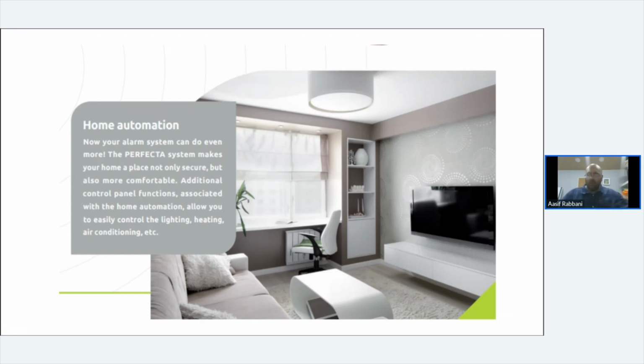So, for example, if the alarm went off, that would trigger a relay to do whatever you've got on the other end of it. Or you set one of your zones up as if it wasn't there to go off. Like, for example, an outside PIR, you wouldn't want it on full arm all the time, because of cats and dogs. I know they're pet friendly, but sometimes something does set it off, and you don't want that going off every time something like that detects it. So that would then turn a light on or turn a buzzer on. So it works quite well with small scale automation.